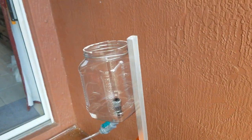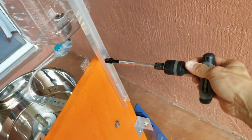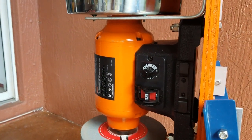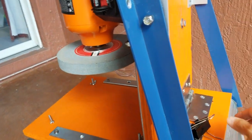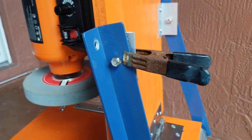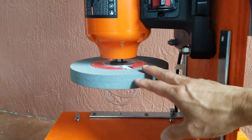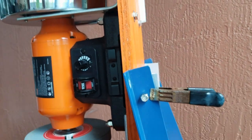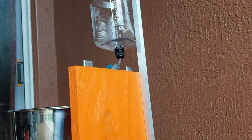A couple of last tips: I built this to be modular, compact, and mostly tool-less. However, because parts are removable they'll be loose, so you'll need to tighten down your hex to keep it from rattling. This bench grinder runs at 2,000 to 3,400 RPM. The drop-down legs are loose so they can swivel, but that can be overcome with a large binder clip or a small grip clamp - two of those do the job in my tests so far. Stay tuned for video number two where I do some mods, and also when it flips to desktop mode I've got something else in mind for polishing.